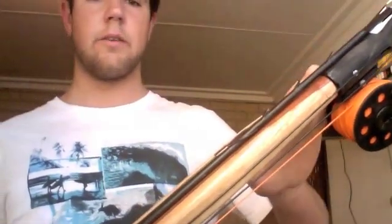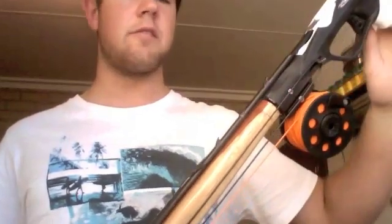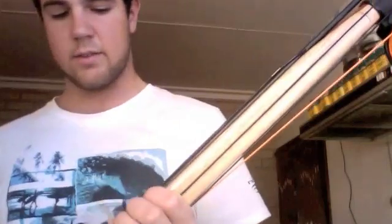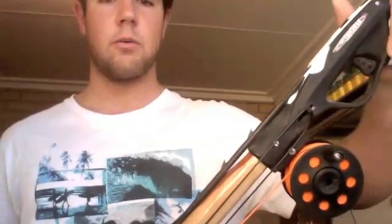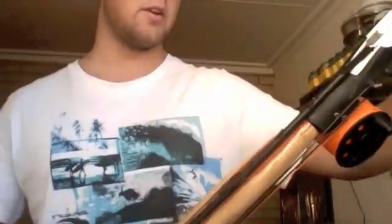I put some of my epoxy glue inside on the wood and a little bit on the screw also. So when I placed it, screwed it all in, left it good and tight, and I left it to dry for 5 whole days without touching it. The epoxy takes 7 hours to dry and 5 to 7 days to harden, to cure. So I've left that, and now it's good and strong. The handle won't twist because of the screw and the glue combined. Just a little bit of added strength.